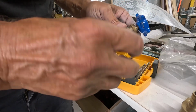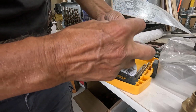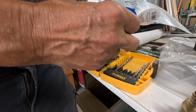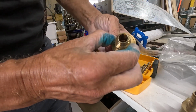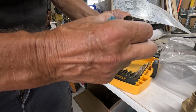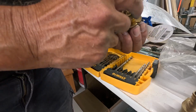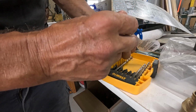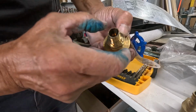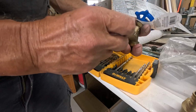when I put this onto this, I want to get it so that I have the flats lined up with these notches, so I got as much room as possible. And then I only want to drill that hole just as big as I need to. I believe that was 1 1/8 inches. So I'll watch my hole size on the outside and drill it to exactly this wide diameter through the wood, and that should do it.